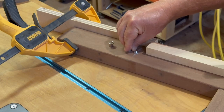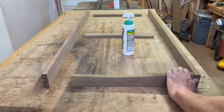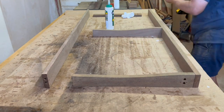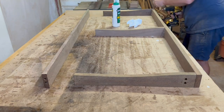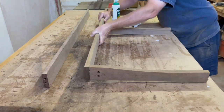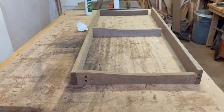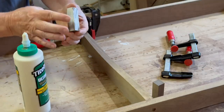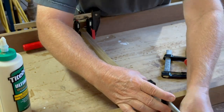I'll leave a link in the description to the ones that I found that are actually truly imperial sizes. I'm using screws to assemble the seat frame — these are stainless steel deck screws, which might not be the strongest choice, but I've heard there's a risk of normal steel screws turning the Ipe wood green over time. All the joints are also being glued so it should add plenty of strength to make up for the stainless steel screws. And just to be safe I add in a few extra support blocks.